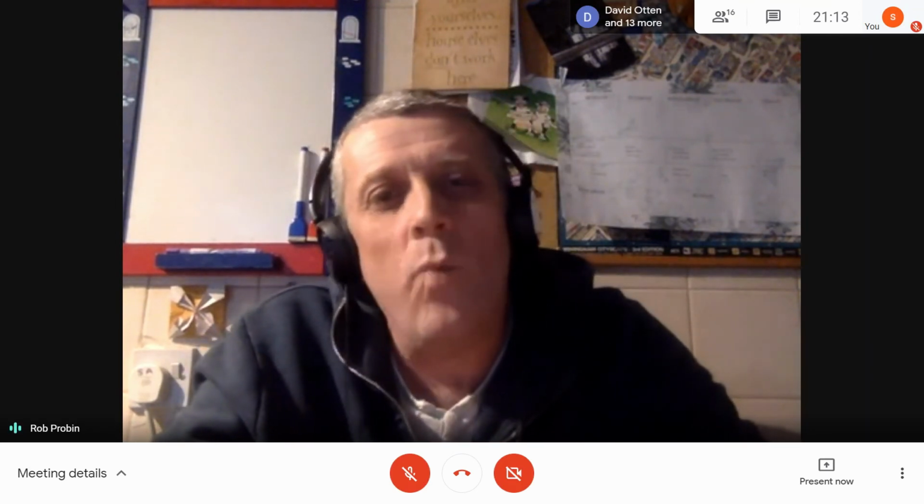but some of the phones won't allow you to get down to the absolute minimum time intervals. And obviously it depends on how busy that channel is. The 2.4 gig channel has a lot of facilities to avoid noise, but some of those obviously end up increasing latency, if you've got a lot of 2.4 gig things in the band.